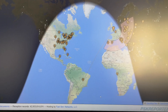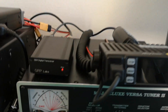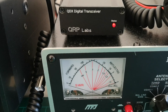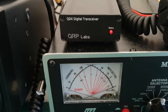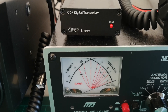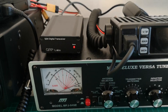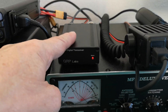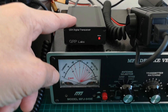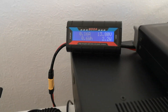That's just what I've received in probably five minutes at most of transmitting, and you can see it really works. There's the QRP Labs QDX transceiver - highly recommended. I've got the version that does 20 meters and upwards: 20, 15, and 10 meters plus the bands in between. There's another version you can order for lower frequencies: 80 meters, 40 meters and so on - I might be tempted to get one of those. Of course it's completely silent, doesn't get hot - just a little warm after running all day at 5 watts output, but no real heat to speak of.